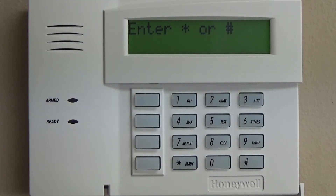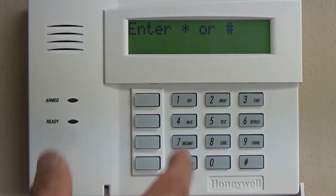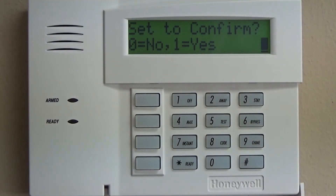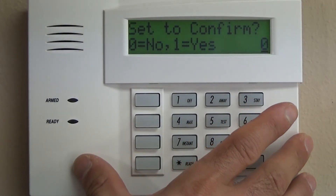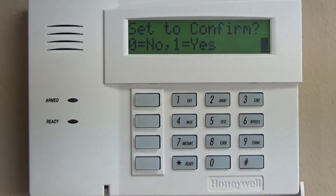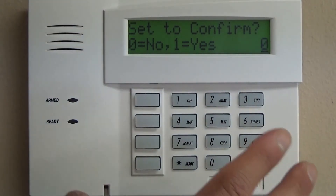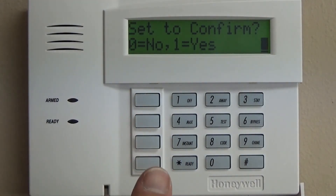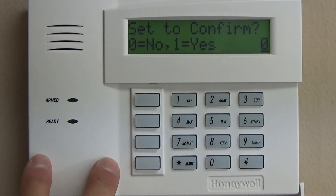Star 99 will usually work depending on what field you're programming. 00 is sometimes needed to hop back into this main menu. From there we can go to star 20 or star 56 and enter back into any of those fields. After this, we're going to go into programming the actual RF keypad, and I'm going to show you how to program an RF zone as your next step. This will change whether you have 8 hardwired zones or 16 hardwired zones, where you'd start at zone 17 with your wireless. For right now we'll keep it simple — I'm going to show you how to enable wireless contact to your 6160 RF and Vista 20 keypad.